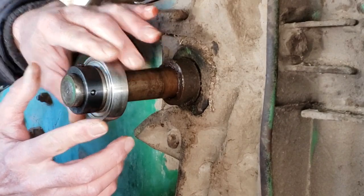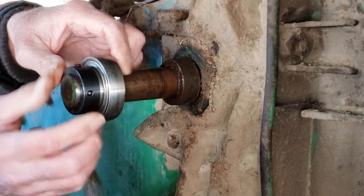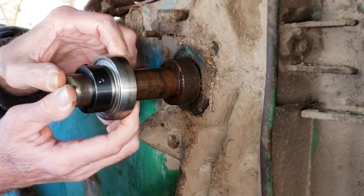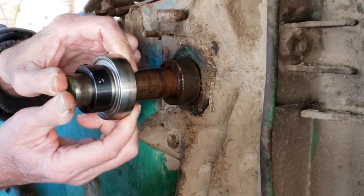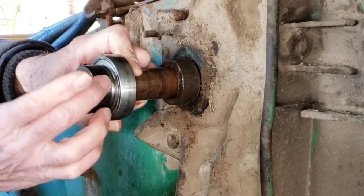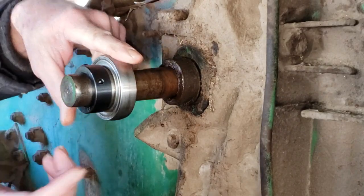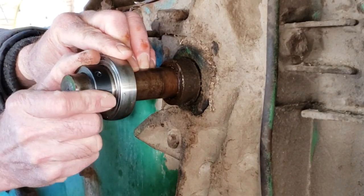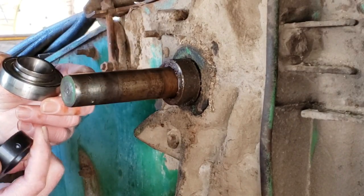Now locked — I'm pushing that way, it won't go. I'm taking my fingers and pulling, taking my thumbs and pushing — I can't bring it to me. I didn't have it truly locked good a while ago. You just take a punch and tap it to get it truly locked. That whole thing was a mystery to me until I got into this repair. Because I didn't set it, I can turn it backwards and pull it right off like that. That's your eccentric locking collar.